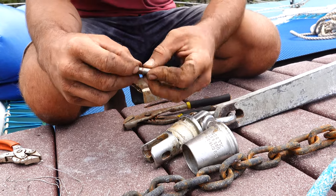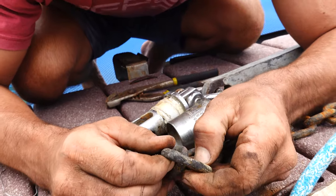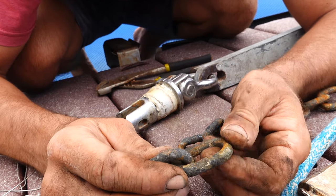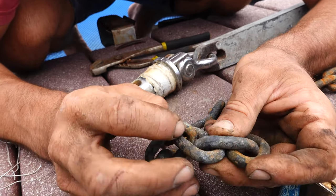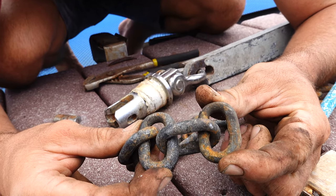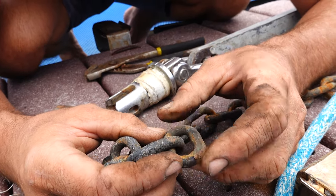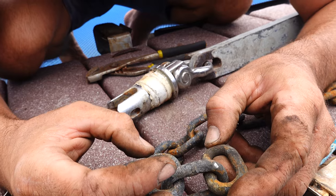There it is — that's the pin that holds the chain. Pretty much no loss in width there. Here's the chain, and here is the last link that was touching the stainless steel — just a little bit of diameter loss. Compared to the other links nearby, there's definitely just a slight difference. Check out the difference between those two: this part was touching the stainless steel, but interestingly the other end of that link shows more corrosion than the part that was on the swivel.